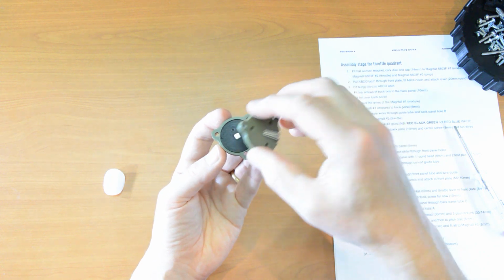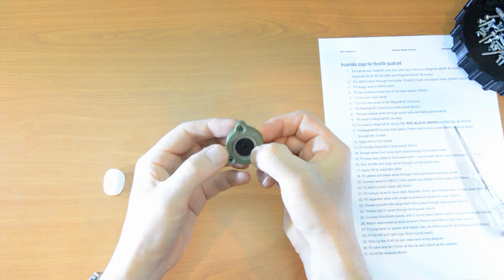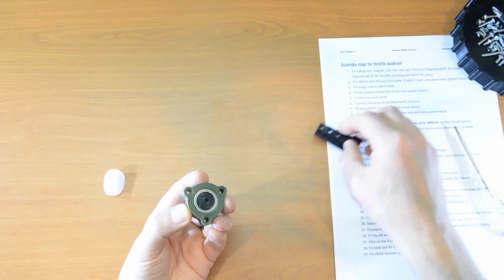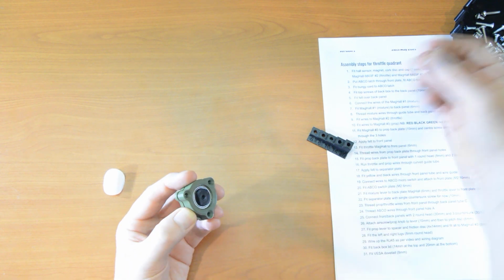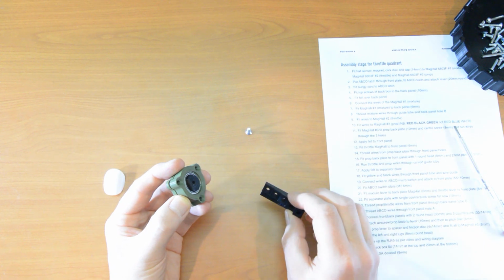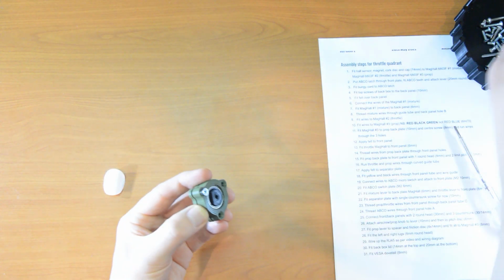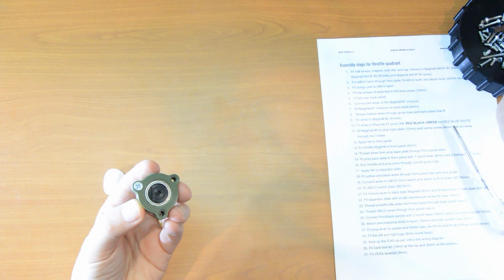Okay, so now we've got the north of the cube magnet pointing at the dimple, and we simply fit the base over the back. Tip that over, and we want 3 14mm screws for that. Quick way to check that it's 14mm. Should be fairly obvious because it's going to be a perfect fit, but that's a 20, it's too long. But I'll just show you a quick way. I think that's a 14, we just drop this little device over it. Yeah, flush to the top, that's a 14. So we have 3 of these. Get those in.